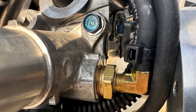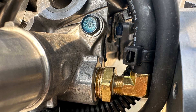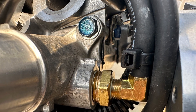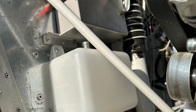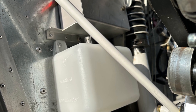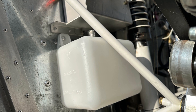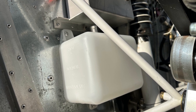The engines are also back to not using any pressure in the cooling system. We've been able to achieve this more reliably by using a larger coolant tank on the firewall and running the hose to it without a pressure cap. The coolant bottle is much larger than in the past, providing a reservoir for additional fluid and making it less finicky regarding top and bottom levels. This tank doesn't have to be on top of the firewall — it can be towards the bottom, making it easier to find room for a bigger tank. It's quite a good upgrade for existing installations as well.